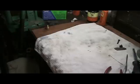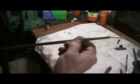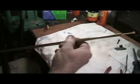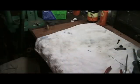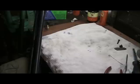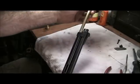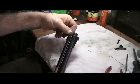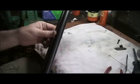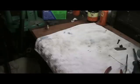And I also polished this loading rod, magazine rod. It was completely corroded. So I took some fine steel wool and went over it and just lightly oiled it. So now I can slide it back into the steel tube rather effortlessly here. Everything's working just perfect. That's where you load your shells there. So I'll go ahead and get it put back in the stock and we'll take it out and test fire it.